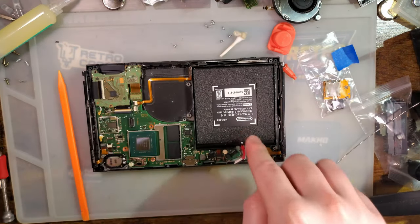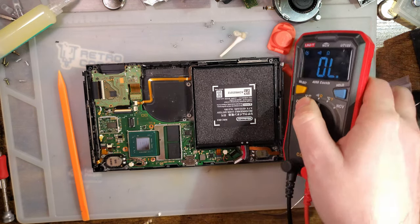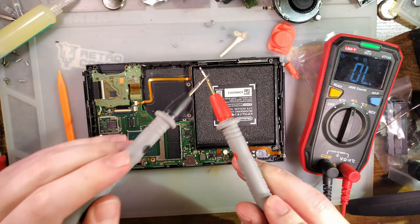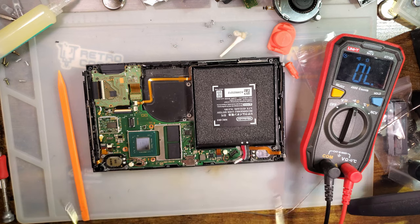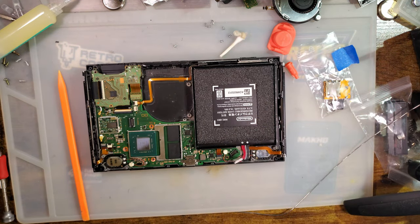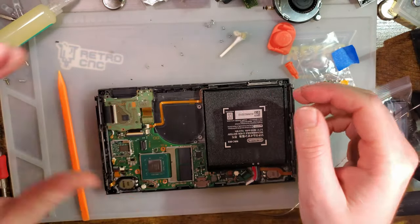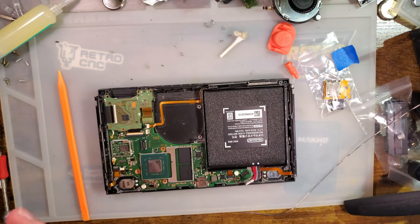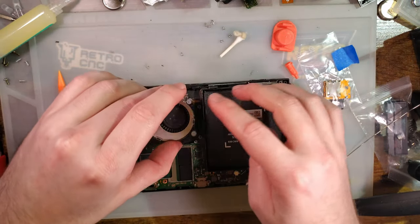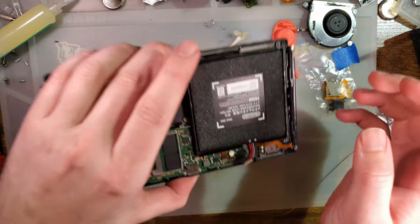And before I connect up the battery, I want to double check that I didn't damage something along the way. Check for continuity on the ground and positive, and there isn't any, so I'm comfortable plugging a battery into that. My other board, like I said, it has a dead short, and that's terrifying to me. Let's plug the fan in, too. It doesn't have a heatsink. We won't need it. Never mind.